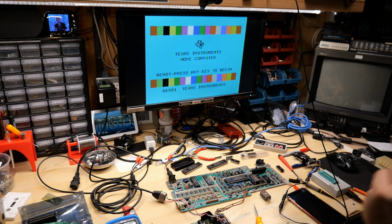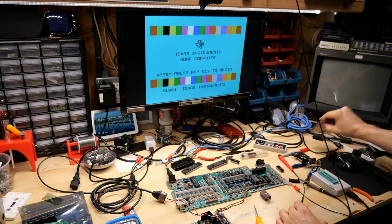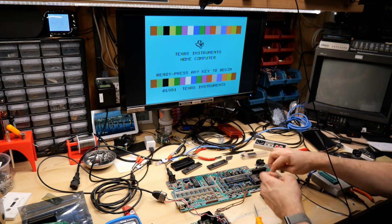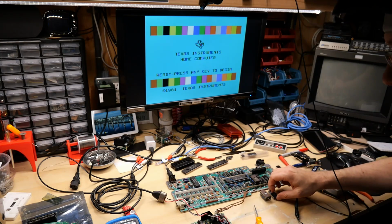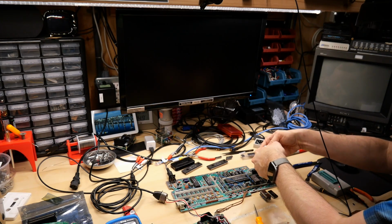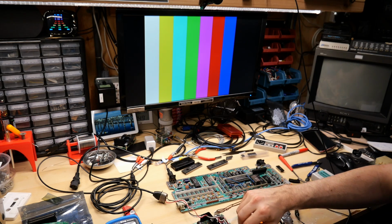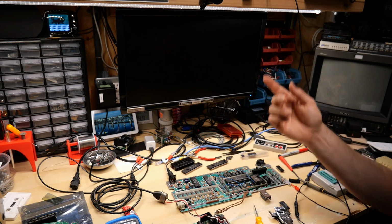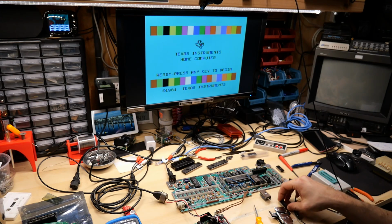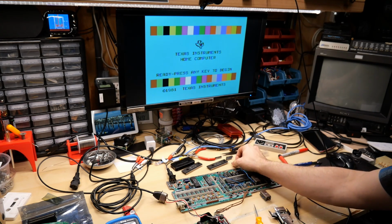So blown away. Okay, I want to see, first of all, if the other SRAM chip works, the one that got exposed to 12 volts. So I'm going to take the SAM SRAM out of here and put in the two original ones from this board. Okay, there we go. Here we go. Oh, okay. I think it works. Yep, seems to be okay. So both of the original SRAMs are good. So this SAM one I didn't need.